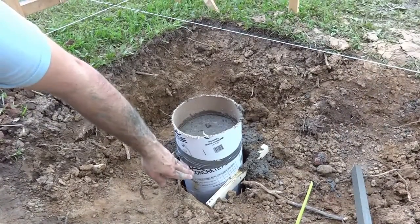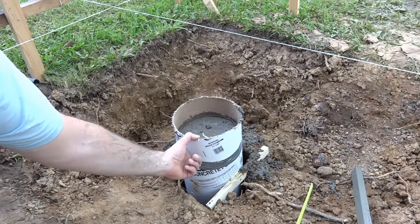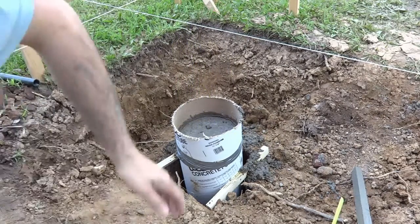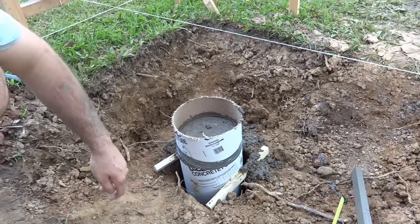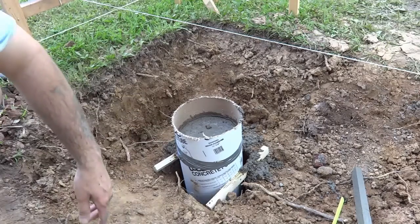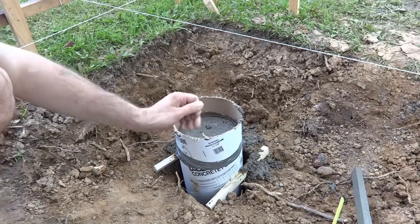I eventually got my tube all the way full of concrete and it ended up sinking down three-quarters of an inch — a lot further than I thought. I took a cardboard tube cutoff from earlier and duct taped it to the top, put in enough concrete on top so it now measures exactly 15 and a quarter inches, which is exactly what I needed. Now I just have to let it dry, then put in the little J-shaped anchor bolt. I need to put gravel around the outside of the tube to help water drain and keep it from shifting. Once it's totally set I'll rip the cardboard off and then fill in the rest.